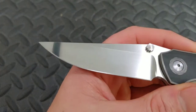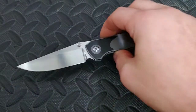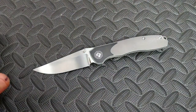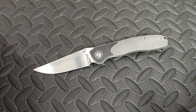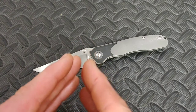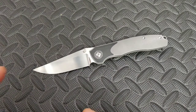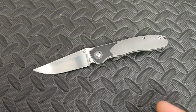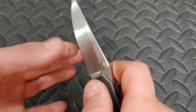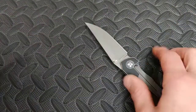Let's get to the edge quickly and then finish this up since we're already 20 minutes in. I put a 1200 grit finish on it. If Andrew wants a mirrored edge I have no problem doing it — this is CPM 154 and from my experience, even though it polishes so good, it does better with some bite. It almost polishes too much and then the edge becomes like a wire — sharp but without teeth. I like a knife to have a little bit of teeth so it's actually cutting with teeth rather than just being so thin it cuts like a wire.